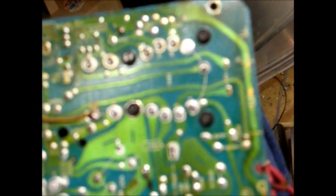I'm now ready to remove the flyback transformer from the donor chassis. The way I usually like to do this is go around the first time and remove as much solder as I can with the vacuum pump, and then go around with the desoldering braid to remove any remaining solder. I use Chemtronics brand desoldering braid — available from most any decent electronics supply house. I don't like the Radio Shack braid; that stuff's not worth bringing home. Just take my word for it and buy the good stuff.